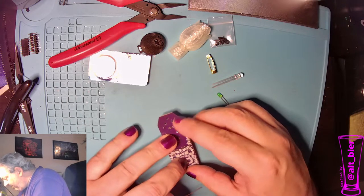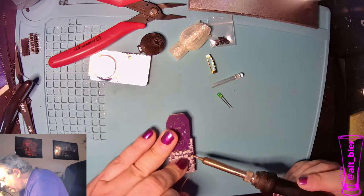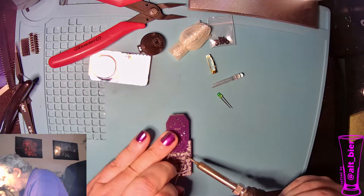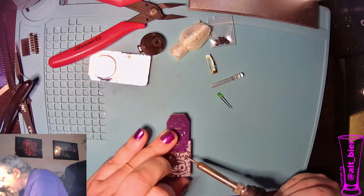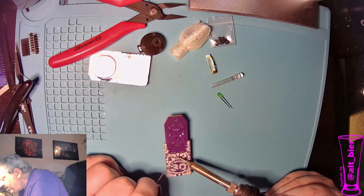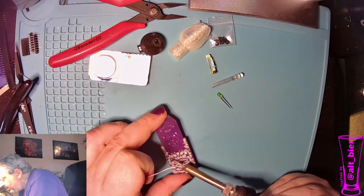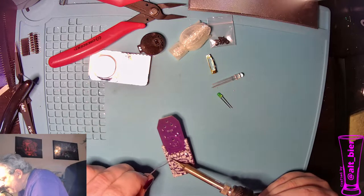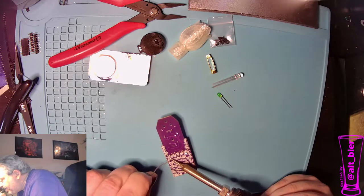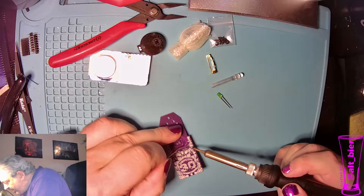And once again, we're soldering on the front of the board. Near the art, so we want to take care not to hit the white silk screen art because that'll leave scorch marks on it. We'll just hit the middle pin on each one initially to make sure that they're all held in place. Okay, and now I can come back and get the top pins.